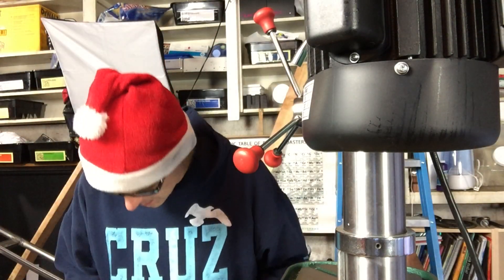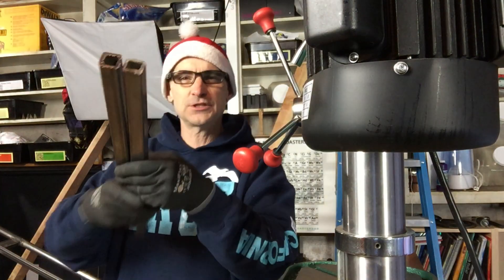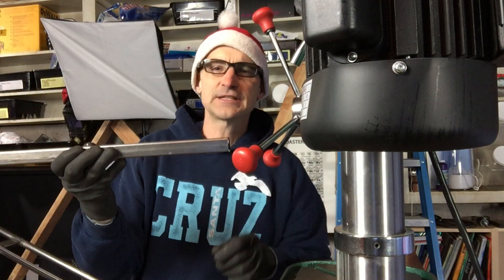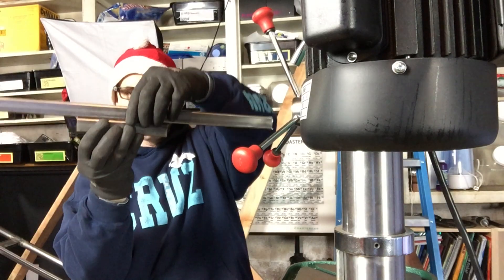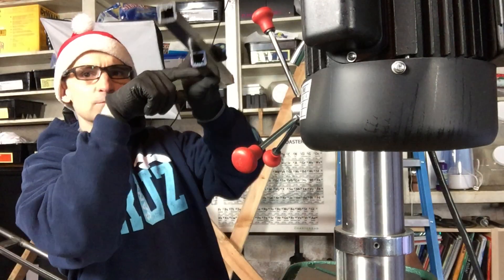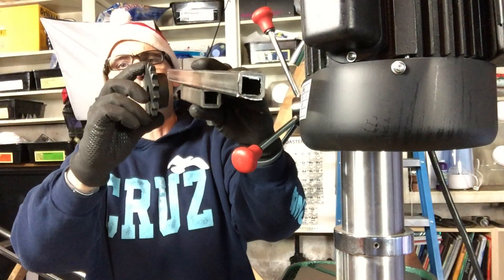So here's what I've got. I've got these two 20-inch pieces of square tube steel. This is really thick 11-gauge steel, so that's almost an eighth of an inch wall thickness. It's really heavy, really thick, really good for holding something important like the chain lift system. What's gonna happen is these are gonna go from one rail to the next, and then underneath that I'm just gonna weld a six-inch piece underneath, and through that will go an axle.